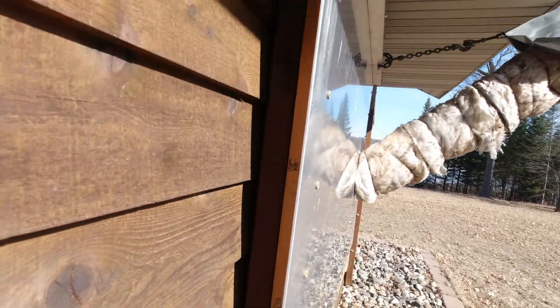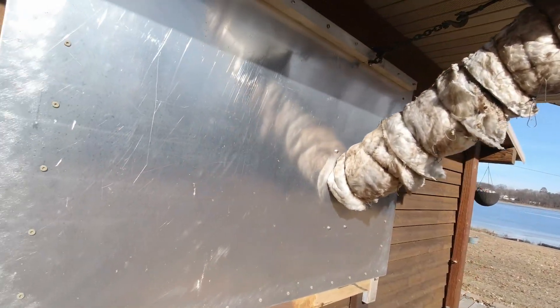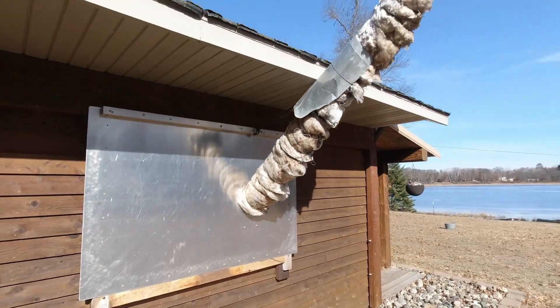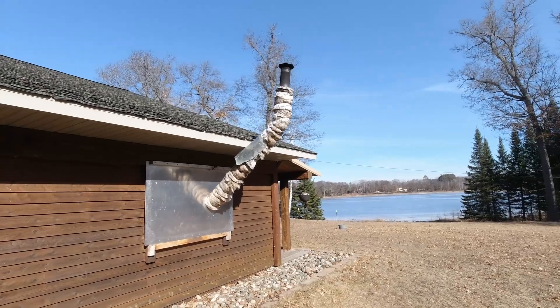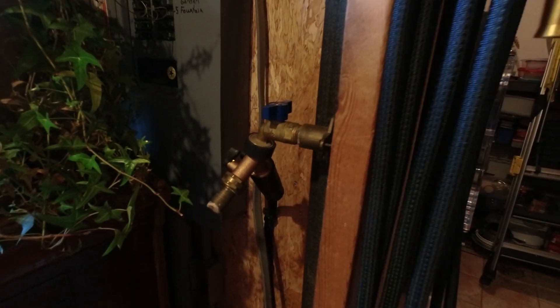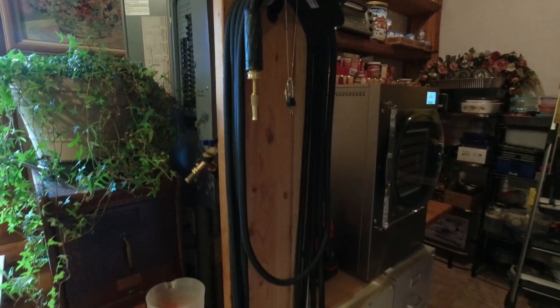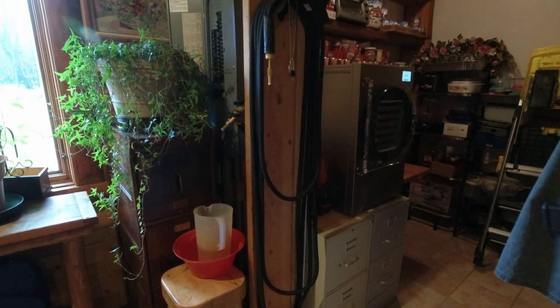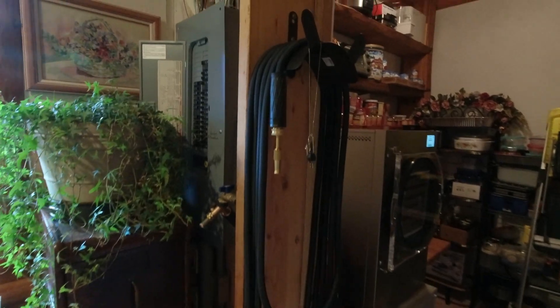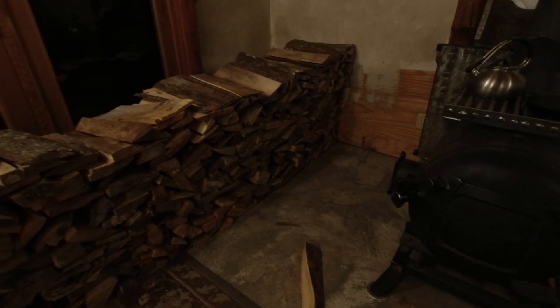The fiberglass wrapped around the outside is working great. That turnbuckle at the top puts a lot of pressure pushing in on the wood stove — the stove started to slowly slide across the floor, about a quarter inch per week, so we added the turnbuckle inside to counteract the weight of the chimney outside. As a precautionary measure, we hung a fire hose in the pantry connected right where the water line comes into the house — we can pitch that fire hose right out the window to reach the chimney, or use it inside if needed.